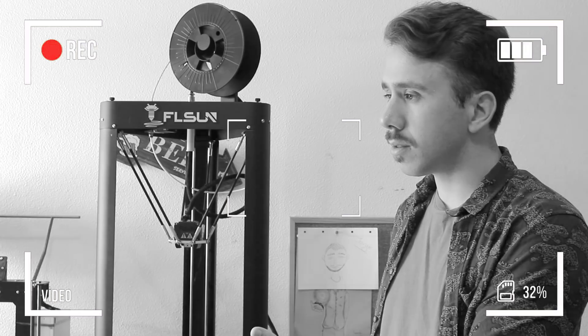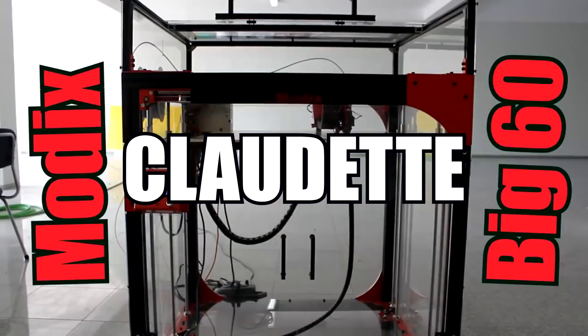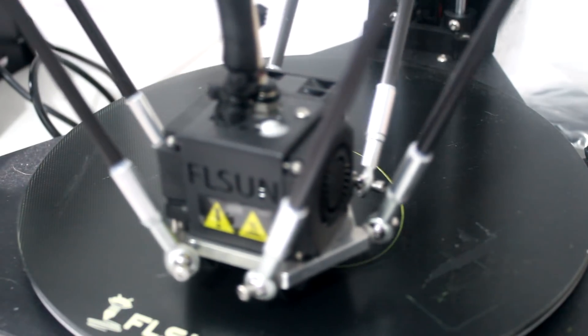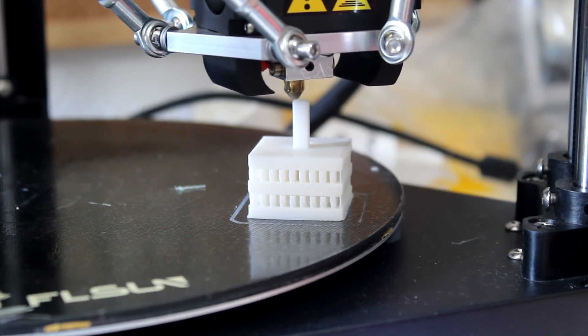I actually got this printer after I started making this video. If you're a subscriber, you know I have other printers — namely Claudette, Sabrina, and Dumbledore. They are all great, but for this I needed something different. Because I needed to print a leg, which is taller than it's wide and has a low surface area at the base, I needed a printer with a static bed so the part wouldn't wobble or fall from oscillation. I also needed at least 30cm of printing height, a light printing head with good positioning precision, and a high top printing speed. That's the reason why I got this delta printer — it has all that I needed and it's really affordable.